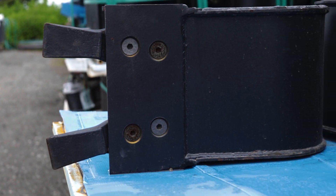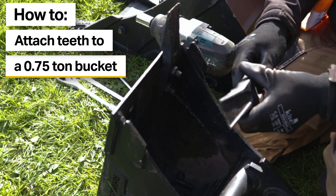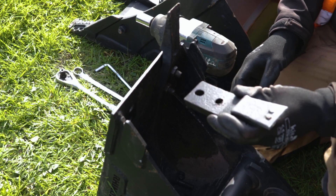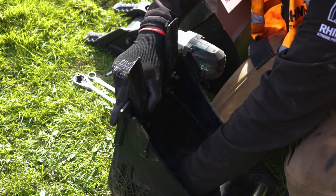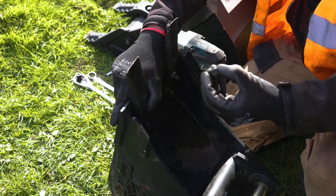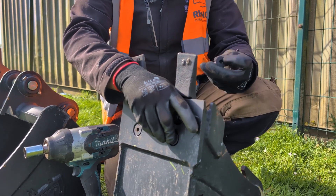If you're replacing your bucket tooth because it was damaged or worn, this is where you would get your new bucket tooth. For the purpose of this video I'm just going to refit the same tooth again. I'm going to grab my bolt and from the bottom I'm going to put it through the bottom hole and line the tooth up, then put the spring washer and the nut back on and just get the thread started to stop the tooth from falling off while lining up the next one.